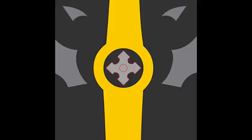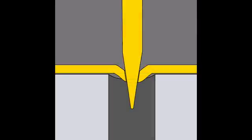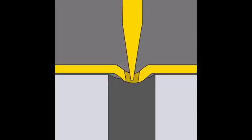To make the hole, I chucked a 1/4-inch brass rod into my drill and brought it to the sander, where I sanded it down to a taper. I then annealed the mount around the hole, and I hammered the tapered rod into the hole while bracing the mount over an opening in a steel block. I continued to hammer until I felt the brass had become work hardened and stopped before the brass began to crack, and then re-annealed it.